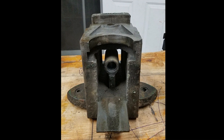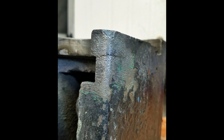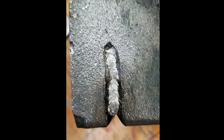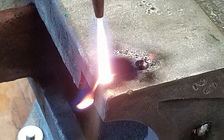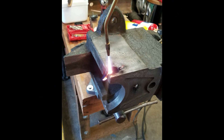I'm two steps below a beginner welder, but we're able to make this happen. I located the end of the crack, then drilled a termination hole. Then I began to hog out a valley with a tungsten carbide Dremel bit. I slightly warmed up the weld area with a MAPP oxy-torch. Final cleaning with a fine wire wheel, then slowly laid down the root pass a half inch at a time, peening with a punch between passes.